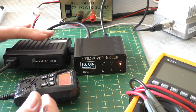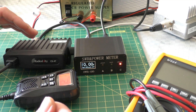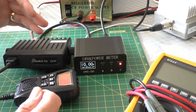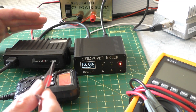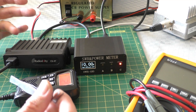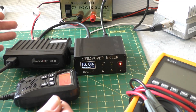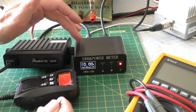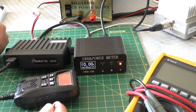As for use of the radio, it did get pretty warm in the shack when I did the testing in the previous video - in fairness it was 32 degrees centigrade ambient temperature, and even the camera started to complain with a hot message on the display. But if you're going to run this at effectively three times the power, it's going to get hotter. Long term, is that going to affect the radio, shorten its life, maybe overload the final transistor? Honestly, no idea - but it is possible. It comes at a risk, but on the other hand that is a simple little mod, and you can't argue that 16, 17, 18 watts out is quite an effective amount of power, especially if you're DXing and need everything you can get.